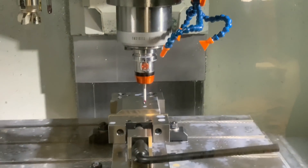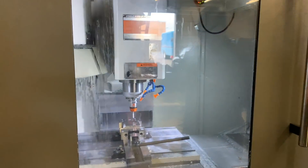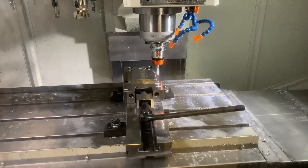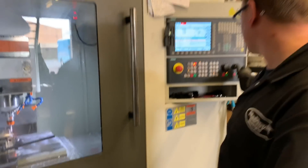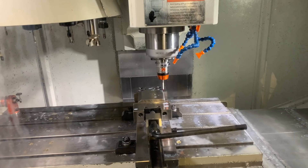Compressors are always running when I'm trying to make a video! Jonathan, explain what's going on. So every part — we don't have to set stops up manually. The machine checks where the part is in its position before it starts cutting, so we don't have to put the part in perfectly — the machine compensates automatically. That's a Renishaw probe. Without it, you'd have to do it all by hand, manually clocking every single one. So this is saving time and gaining accuracy — it also takes out the human error.